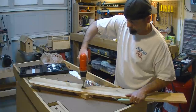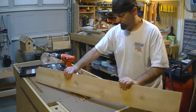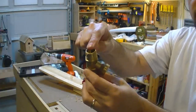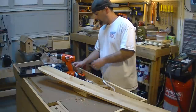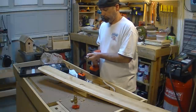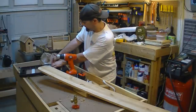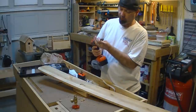What that's going to do is create a shoulder for the spigot — the spigot has a shoulder here. We want the spigot to go through and then the shoulder to hit the inside of that hole. The inside diameter from thread to thread is three quarters of an inch. So now let's get a seven eighths inch bit — that's a little bigger than three quarters so it can fit through. That's what I said in the original video, so I'll follow that.